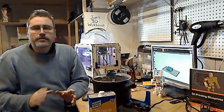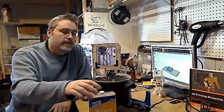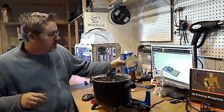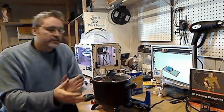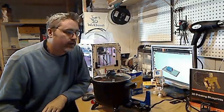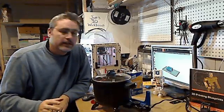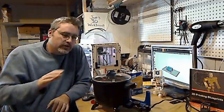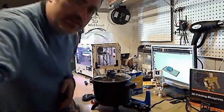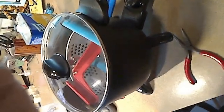For just 2 minutes, you let the heat go. You don't even need to let the heat go for a full 2 minutes. After just a couple of seconds, all of that acetone is going to vaporize and fill the area. These things have a magnetic connection, so they're real delicate, which is good. But I can already see, looking at my print, it's starting to get glossy. Let's see if I can bring you over here to see — see that? It's already starting.